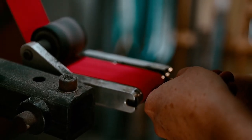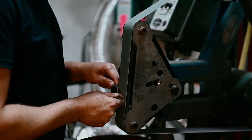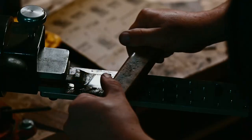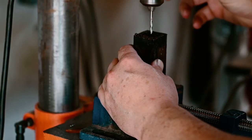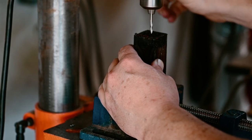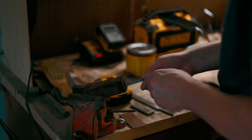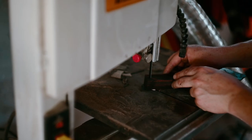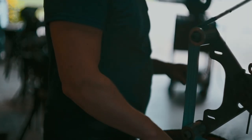I use a small wheel — I think that was like a three-quarter inch wheel — to grind my transitions from the blade to the bolster, and then I clean it up with a rotary platen. There was a lot of hand sanding and stuff that I didn't film, and a lot of the handle stuff I didn't film while making this video. Just some general shaping, trying to keep everything nice and centered, grinding the bolster nice and clean.